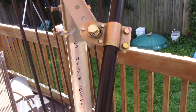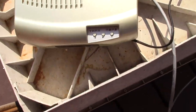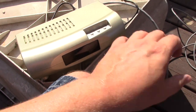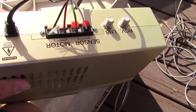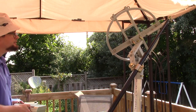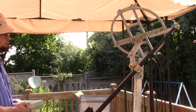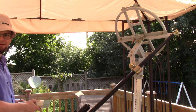Part of my test here was just to get the actuator extended so I can test it out and make sure it's working — it's all wired up inside. I have the V-box right here and I just need to set that up. The way I have it set up is with the two power cables and the two sensor cables. The sensor started basically at 999 and it's worked its way down to 200. When you see the actuator move you'll see it kind of swing a little bit. I might need to move it back a bit so it goes a little more west once we've got the dish on it.